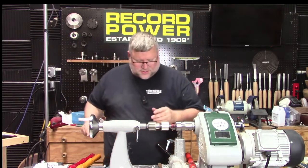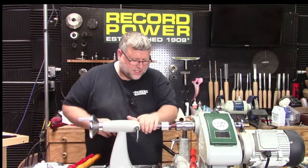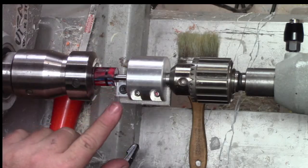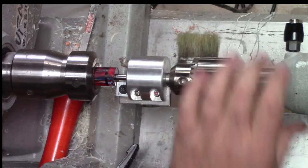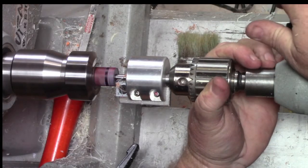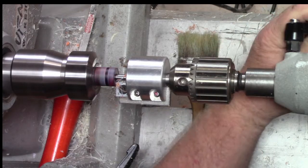And then also I always say, make sure if you're holding this, hold your drill chuck. Don't hold the tenon cutter, because if it spins, you've got a cutter head up here, as well as the plate, which has corners on it. You don't want that to cut your hand, so hold it in a safe spot. And then you just kind of slowly ease into it.